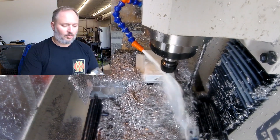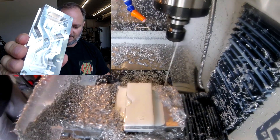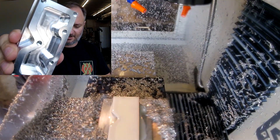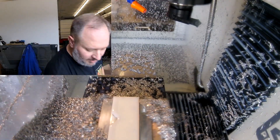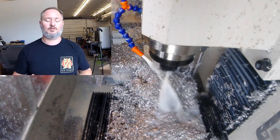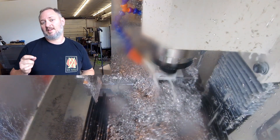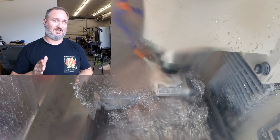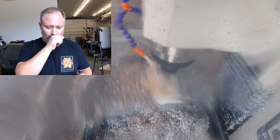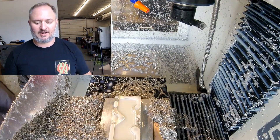Here's why — when I'm pushing that cutter, it's flexing a little bit, and the floor was not finishing without that extra pass. Pushing it at that point — it's not a terribly heavy load compared to big machines, but for the machine I'm on, it's just enough flex where it was leaving about 7 thousandths consistently. I know at those feeds and speeds I was getting 7 thousandths excess on the floor. So when I came around and did my contour at 1 thousandth above, it was leaving me about 6 thousandths of material sitting there. By doing that horizontal path to come in and clean up the floor, it cleans all that up and we're good to go.